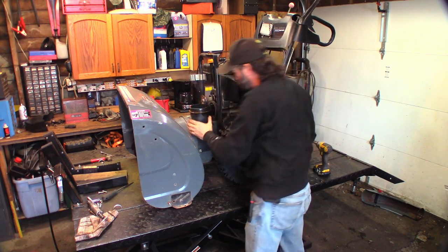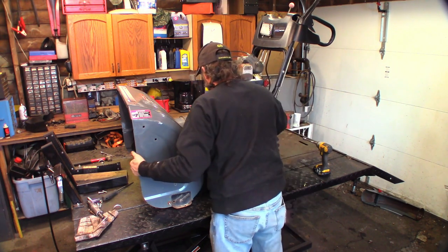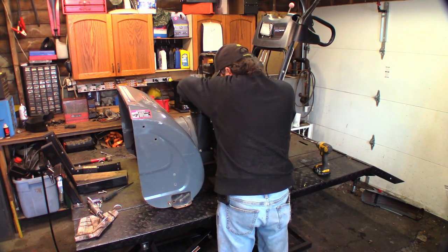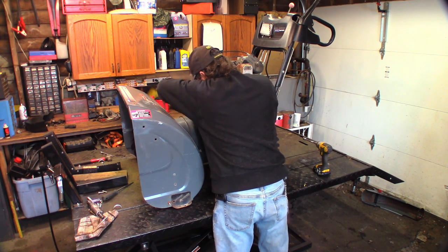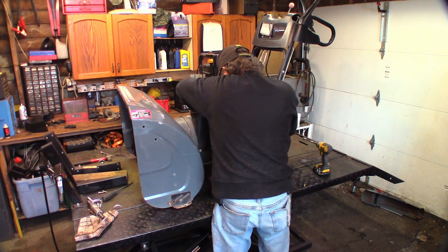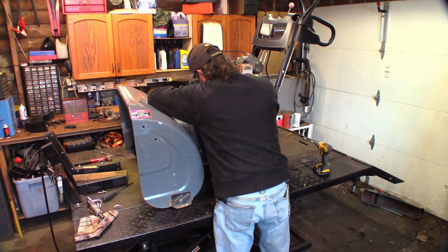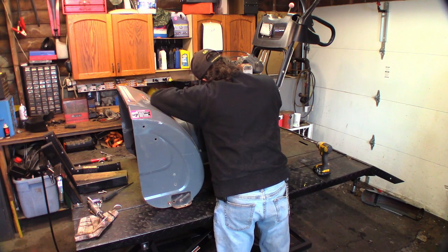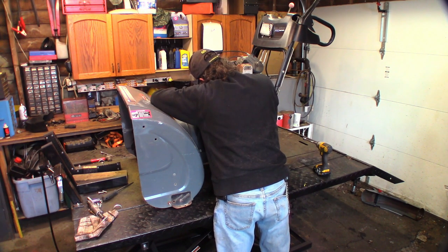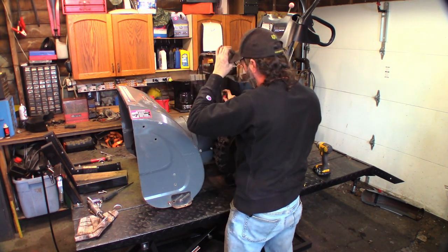Now that's our auger belt. Let's have a look-see down in there. Something's awful growly back here. Could be something stuck in behind the impeller between the impeller and the housing. It must be, because only the impeller is turning - the shaft isn't. There's got to be something stuck in behind the impeller. Everything is so tight you can't see anything. I see something - actually it looks like a bolt. The bolt came loose. Dang it, we've got to split it.